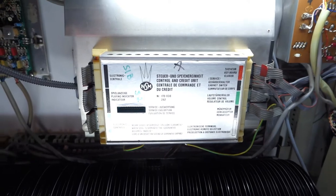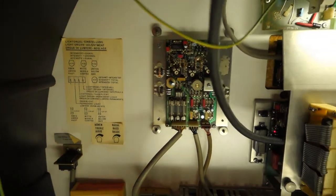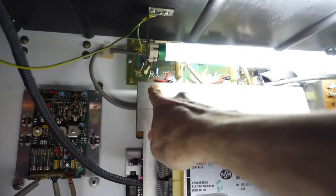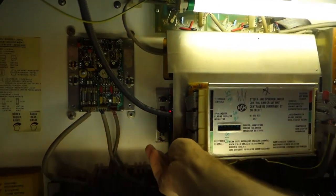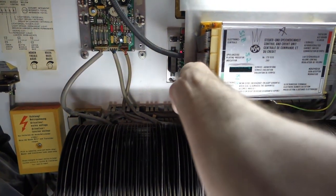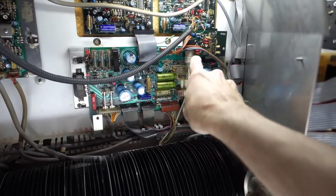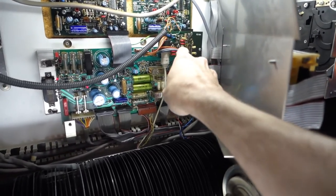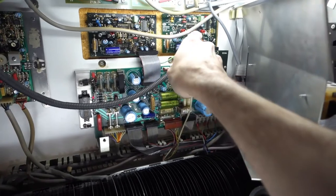And right there we got the computer. Behind that are the amplifiers. And over here is the board that controls the lights. Also, as we go up above, we've got some speaker networks up there and some remote control networks right behind the light bulb there. But we'll pull off this screw here, and we'll pull back this guy to reveal the power supply board. This is a board for optional audio input, so you can do an auxiliary input like a paging mic or whatnot. And as you can see on the front panel, I've added that remote functionality, and these are the amplifiers.